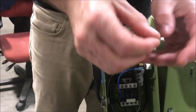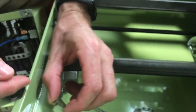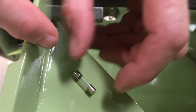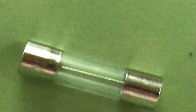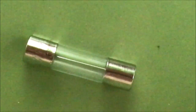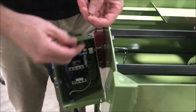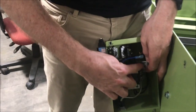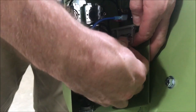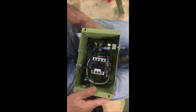If you take a look in there — I'll put this where you can look down here — you'll see there's a filament on the inside. I'll take it and show really close: there's a little filament, a little piece of wire going through the center of that — that's the fuse. If your fuse looks blackened on the inside like something burnt, that means you blew your fuse. The causes for fuses being blown can be a variety of reasons. This one's fine. If your fuse is blown, you can remove the extra one, pop it down here, and snap it into position in the box.